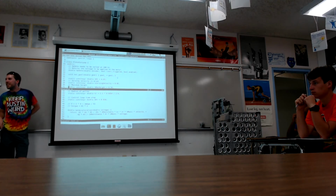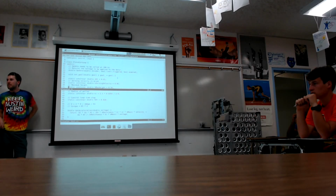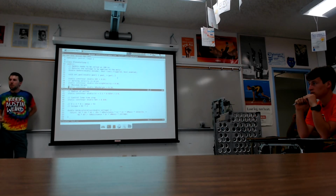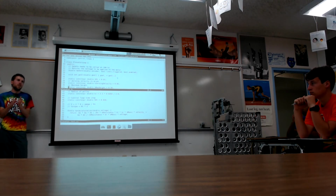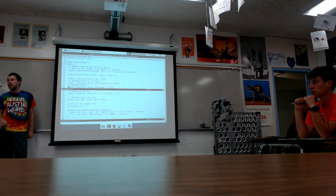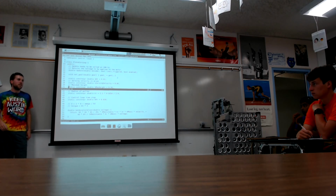Basically, you build your robot in layers of tests that you make sure all work. That way you're really free. So the goal is to write a lot of tests, and as you're building your robot, you have test cases to show that all the little pieces work. One of the really cool benefits of this is you can start programming before the hardware exists.